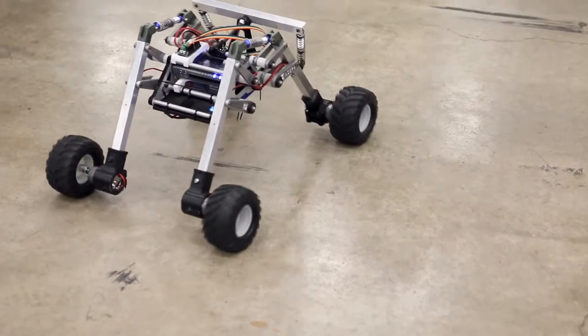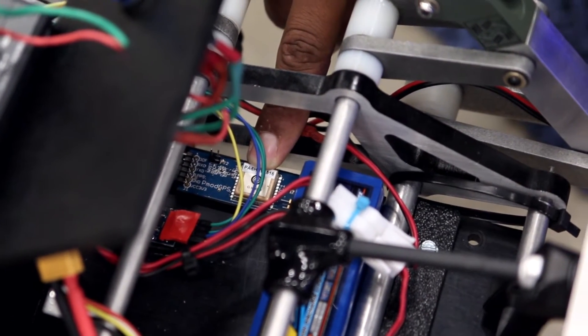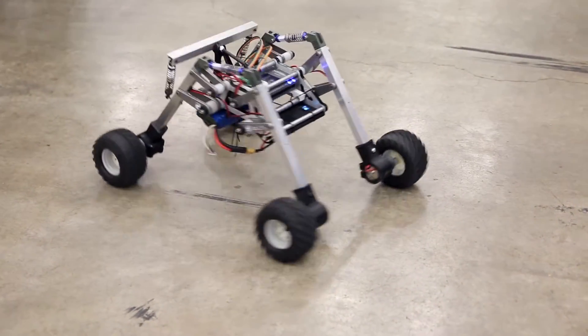The point of this project: we had a mission statement given to one of our classes in the Electronic Systems and Engineering Technology department at Texas A&M. We had to basically find a cheap solution to travel from point A to point B using the NI myRIO technology. The class came together and saw what modules we could use. The two modules we chose were a GPS module and an electronic compass to tell us where we are on the globe and what direction we're facing. We used what's called the ASEP robot to basically take us from point A to point B.